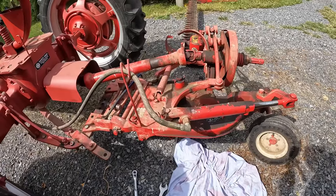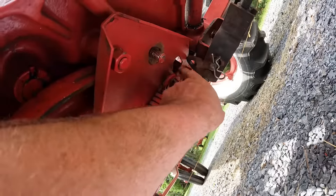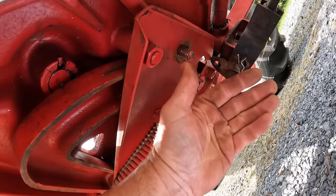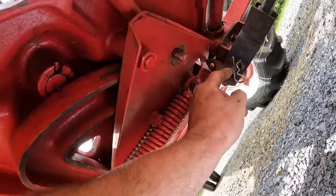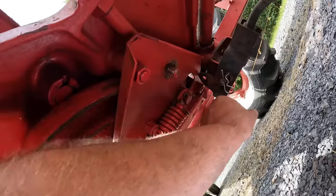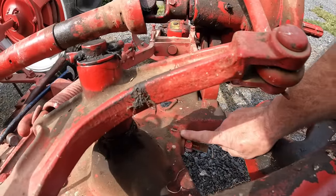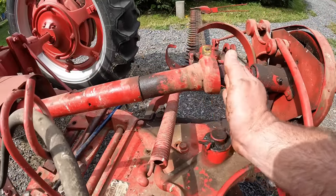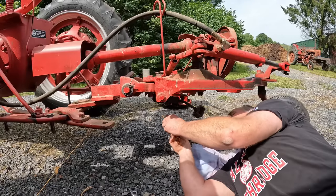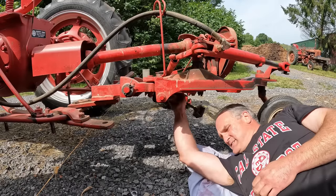With old equipment, things wear. Under this plate there's a breakaway spring attached to a little bearing on a track. When the mower hits too much weight — say a fence post or a big rock — this bearing pops out of its groove and allows the whole thing to travel back, tripping the mower. I think the bearing has worn in the groove and isn't sitting in quite the right spot. The manual describes a threaded rod you can adjust the nut on to pull this whole assembly forward and correct the position. I just need to tighten it back up.